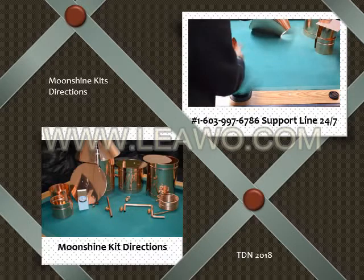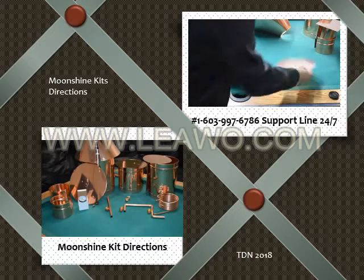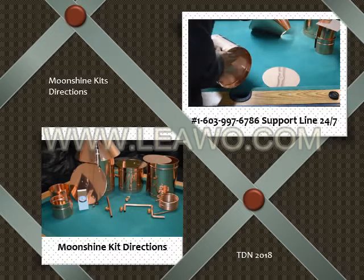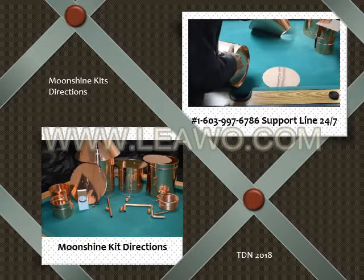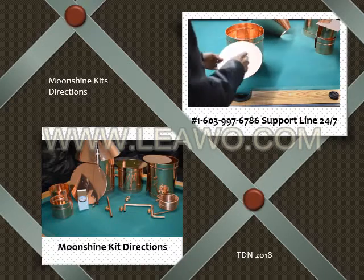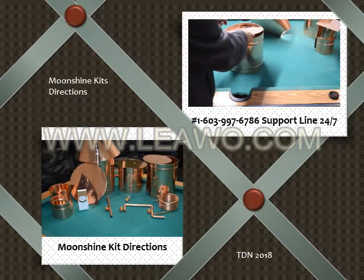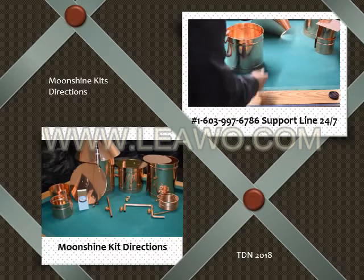Thumper comes with two circles. Same thing as the pot. Put the bottom in there good. Solder it up. This one's gonna have two holes in it. Grab a tool from your shop right there, or make something up to pull up the edges to be able to solder that nice and flat. There's your Thumper.